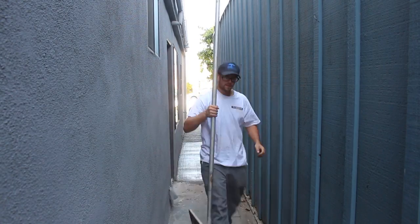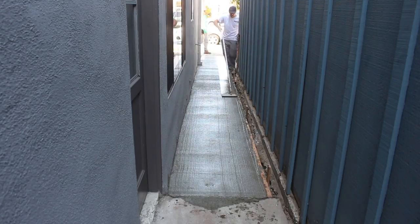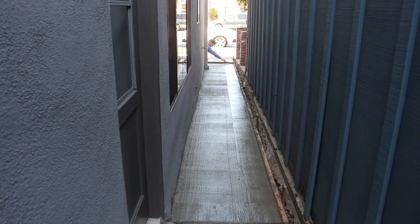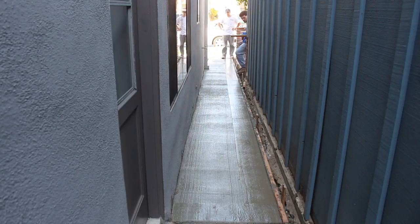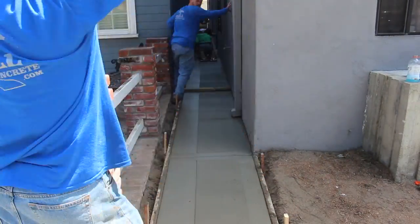For the bull float, I had to break out the wood bull float on this one. It started out as about a four-foot wood bull float — I actually cut this one down just to fit in the space, which worked out real nice. You can rent some of these tools at the local rental place; they rent concrete finishing tools if you want to do one of these at home. This side yard isn't going to be seen or used a lot, so it's a good one to start out on.